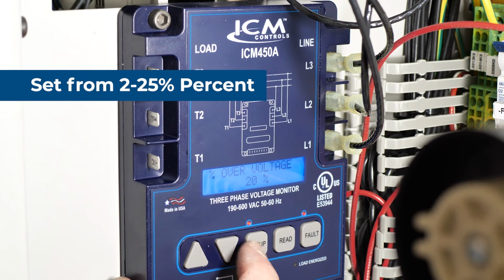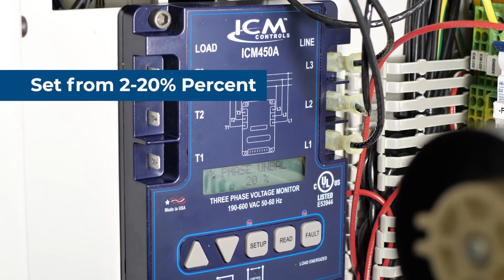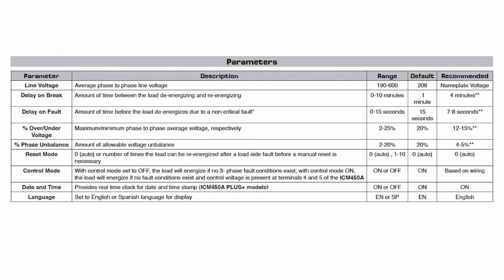Set your overvoltage percentage to the recommended value or to equipment specifications. Then, set your undervoltage percentage to the recommended value or to equipment specifications. Lastly, set the phase unbalance to the recommended value or to equipment specifications. To see the full setup menu options, descriptions, and recommendations for the ICM450A, refer to the installation guide.